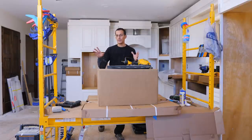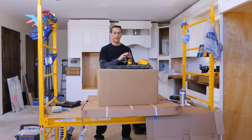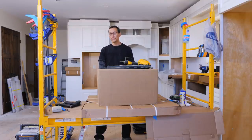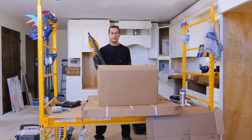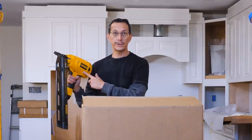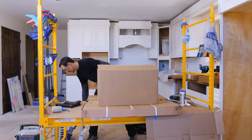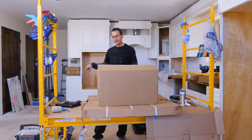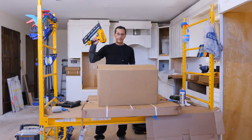I want to take a quick sidebar to nerd out over tools. I've used a lot of different brands. I like the Makita corded tools — circular saw and power planer, never had a problem. The corded DeWalt tools like the Sawzall have always been great. Unfortunately the pneumatic tools from DeWalt — I've had bad luck. This framing nailer I've had forever; the seals quit working and I had to replace the O-rings. I made a video on that. It still works but it's temperamental — it likes to go off even when the nose isn't pushed down.